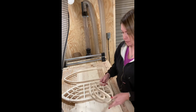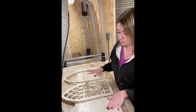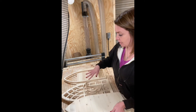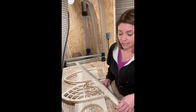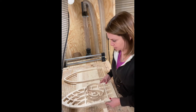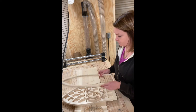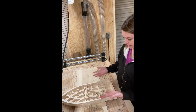Let's see how this all looks together with this beautiful monogram. A couple of things I've been thinking about while designing this: it's all a very beautiful design put together, but I need to plane the backer down because it is three-quarter inch wood — the same as the other pieces. I would plane it down to maybe a quarter of an inch, just because it's too thick when you put it all together. When you put this backer on, you could paint it — I have a paint business so I have all the colors, plus a paint chart for colors versus staining. The topper cathedral is also three-quarters of an inch to match the monogram so it's not sticking out.